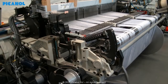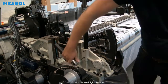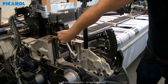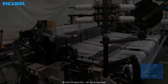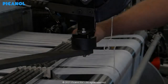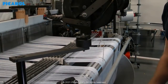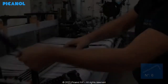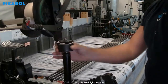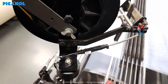Mount the warp beam back in the loom and mount back the support with the flange bobbin and hand tighten. When no longer needed, remove the vertical creel. Place the flange bobbin directly on the shaft instead of mounted on the extra arm. Make sure the separated detection is mounted and connected with the provided cable.